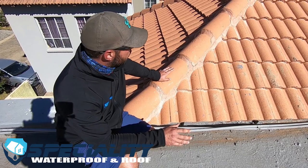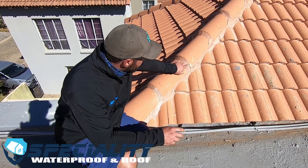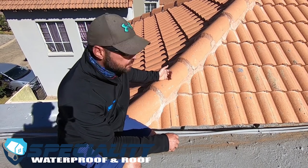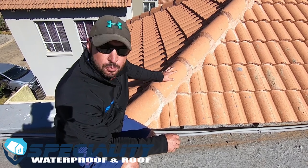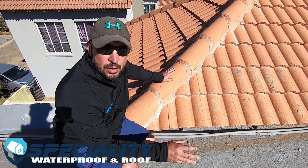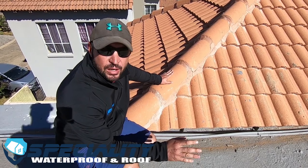What we're doing on this roof ridge is we're going to be looking for plaster cracks. As you can see here, we've got some plaster cracks that will allow rainwater to come in and seep in. We're going to take out any loose plaster, re-plaster where needed, then waterproof the ridge, and paint it with a roof coating to protect it against UVA and UVB rays — ensuring this system lasts maintenance-free for at least five years.